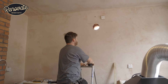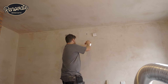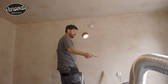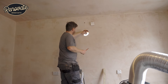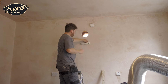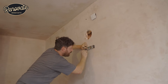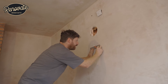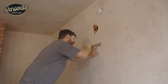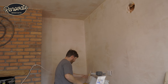I had a mild panic because this wall has been plasterboarded and not blocked up. I was just concerned about getting a decent fixing on this plasterboard for the weight of the hood. But what we can do is reach in here and get a timber batten behind, screw that in place, and then screw our bracket to that timber batten. So that is what we're going to do now. I need to cut a piece of timber and screw that in place.